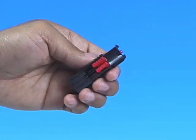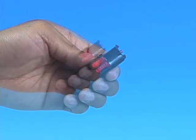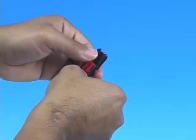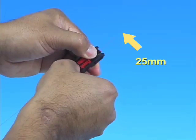Inspect the 250 micron fiber holder and ensure the grooves are free of dust. Ensure that the fiber holder clamp is in the open position by sliding the clamp forward in the fiber holder. This is evidenced by the small red tabs protruding from the end of the fiber holder. Insert the cleaved fiber into the center groove with a total of 25 millimeters of fiber protruding from the end of the fiber holder as shown.